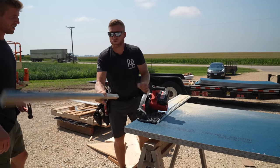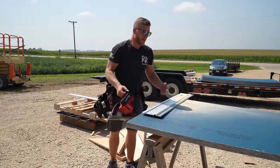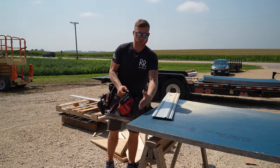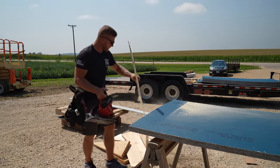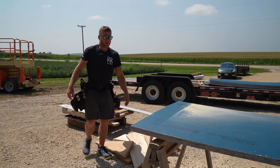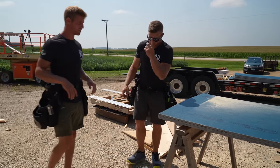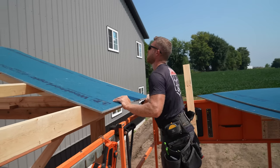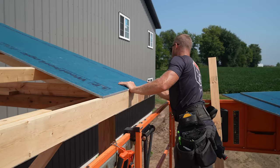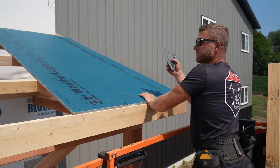These first three are the ones we had to take an inch and a half off, and that is because we do a staggered purlin — we always figure everything to be a perfect flush fascia and sheathing at the bottom. But whenever we stagger down, we're obviously going to lose an inch and a half. Let's go ahead and get this installed. With the WeatherLogic, since it's a really premium product, I feel good about its dimensional characteristics, and we framed this all square.